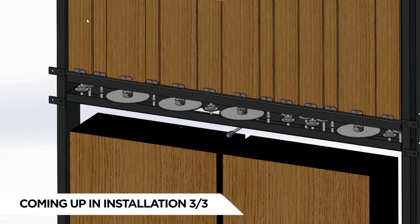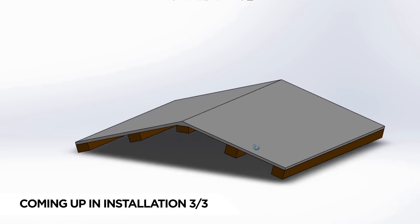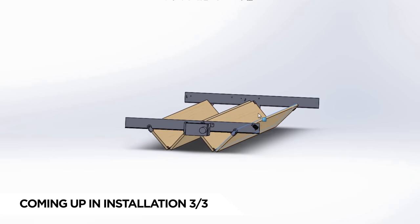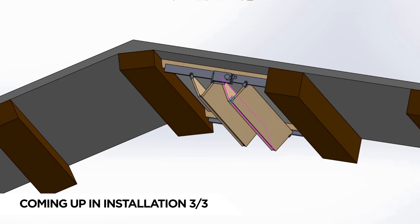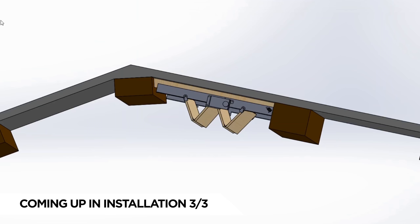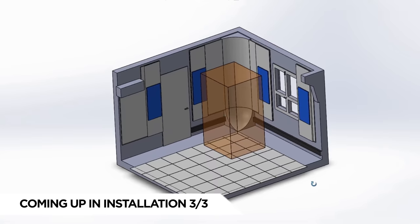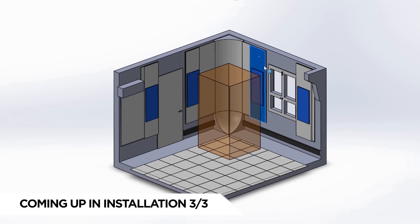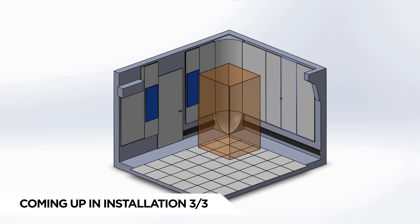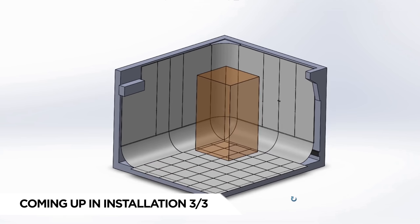We have three different surfaces that offer acoustic tuning: the wall on the stage, with vertical slats that are rotating. There will be foldable wood panels above the machine that will just slide like this and let the sound be absorbed by an acoustic ceiling above. And the third acoustic solution will be on the cyclorama. The cyclorama is installed in front of openings of the room, doors and windows. So it will have some opening wood parts that will be covered with acoustics outside. So when you open, it becomes acoustic, and when you close, it's just a cyclorama. This way, we have three different parts of the room that can have variable acoustics.